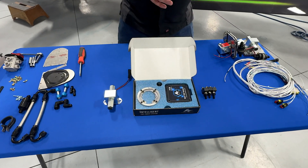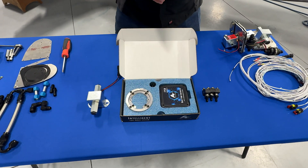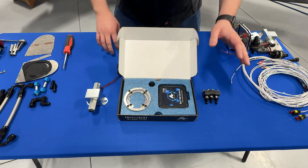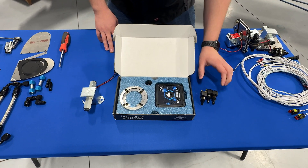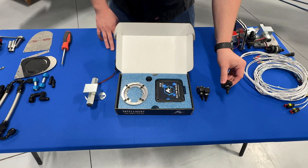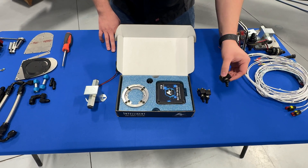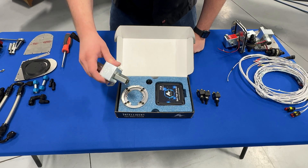So this here is the base kit — the main box that most of the components will come in. For items outside the box, we've got three double-pole single-throw switches. Two of them are going to be replacing your Rotax fuel pump switches, and one is our boost pump override switch — the switch you throw that forces the boost pumps on if anything ever goes wrong. This is one of two fuel pumps you'll be getting.